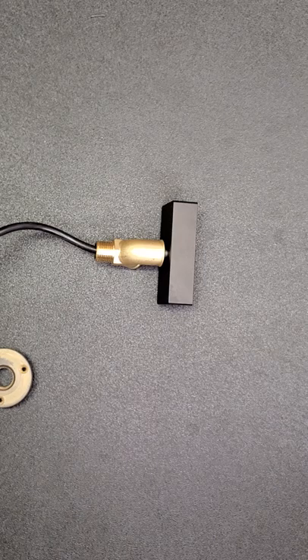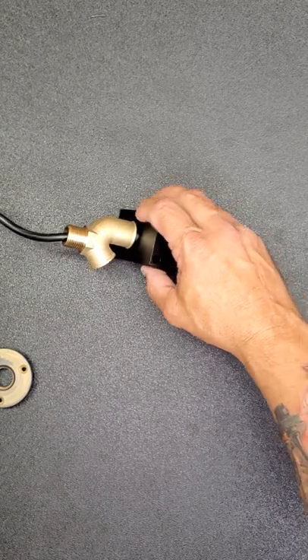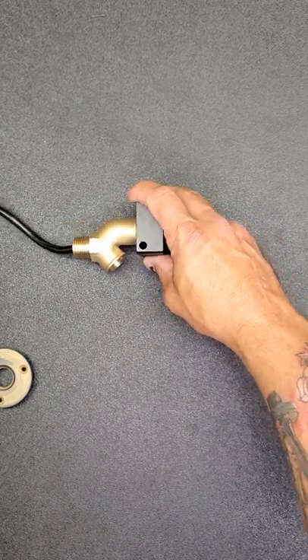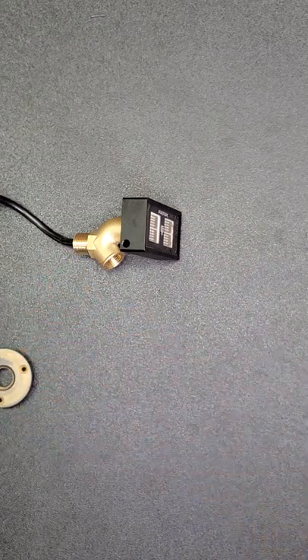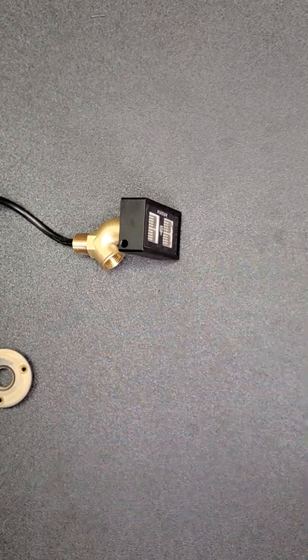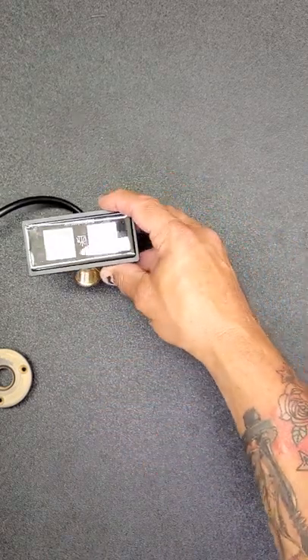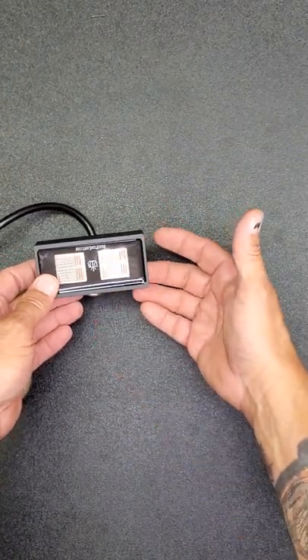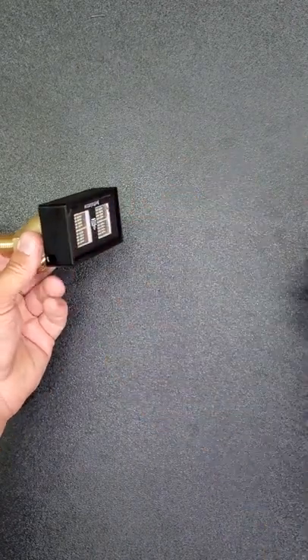It's all one unit and doesn't require any modifications to your boat — nice and simple. It's made from H59 naval brass. Always use at least PTFE paste, or ideally teff gel, which is the best thing for any saltwater or water application. Use that on the threads and you're good to go. You'll still want to check the clearances for your specific light, but it would have to be a really drastic situation for this not to work on your boat.